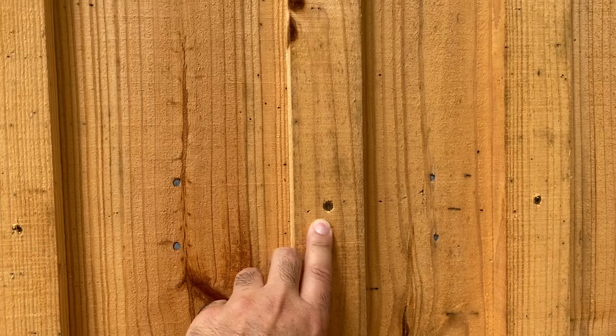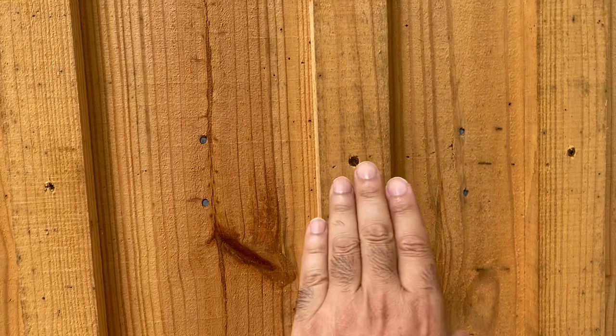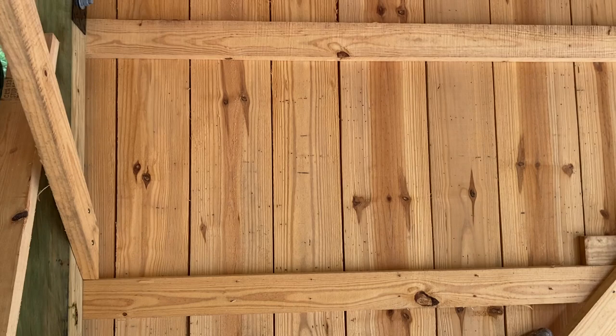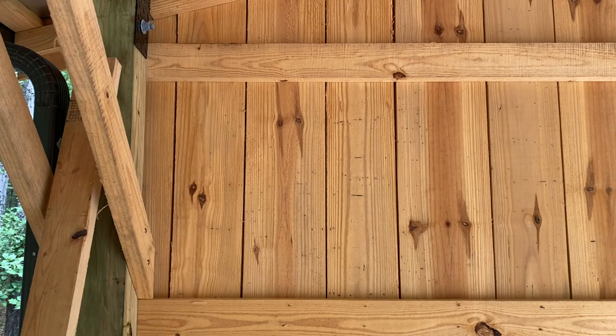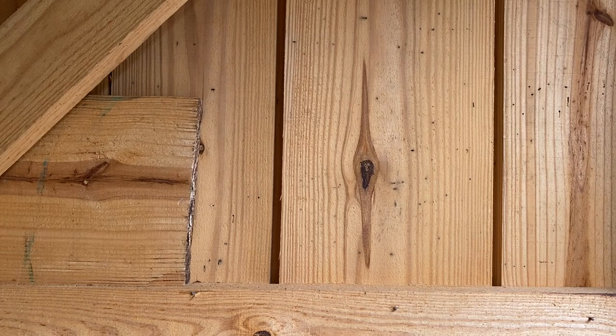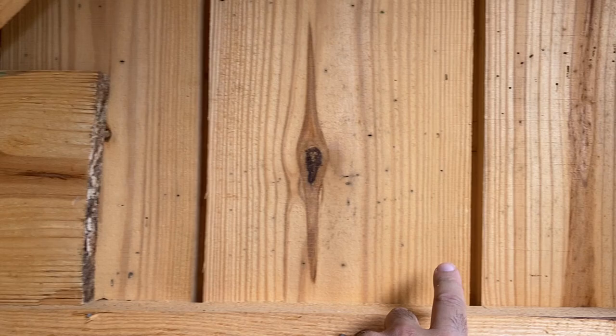We don't want to constrain the edges. If we had put nails on the edges, when they go to shrink they're going to split and cause cracking. So we only nail the board right down the center. Then we come back and fasten the battens down with about a three-inch star drive deck screw. Those screws go through the joint between adjacent boards, so they're also not going to constrain the boards as they shrink. The battens get screwed down tight, helping hold in the edges of the boards and covering up that joint. Coming around to the inside, you can see I had butted these boards up as tight as possible, and there are now pretty substantial gaps ranging from about 3/16 of an inch to a quarter inch.